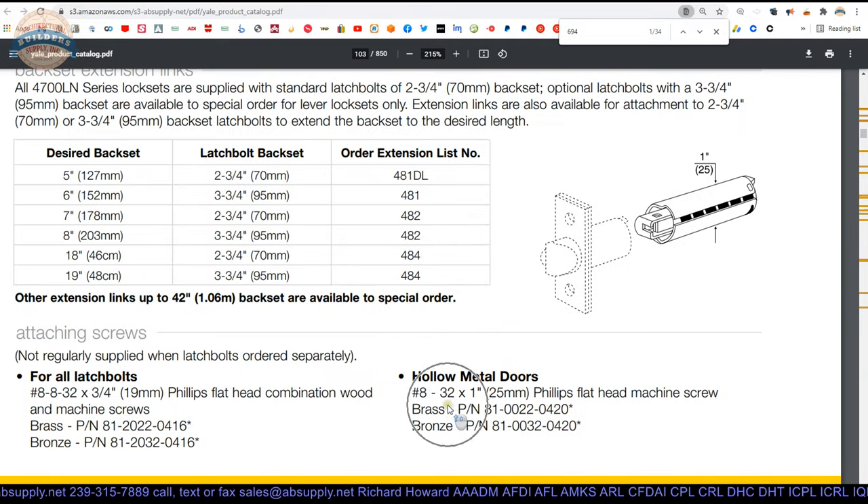Since we're on the page — I've also had Yale manufacture custom backsets for clients. I think we did one that was six inch, not very common, but an unusual backset, and they do a really good job at that. Two and three eighths is known as residential; there's also a two inch backset in residential for dead bolts. Two and three quarter and five inch are considered commercial.